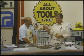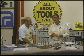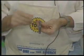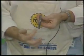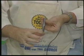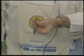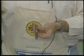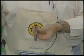One thing that I was really fascinated, and I was telling John this a little bit earlier, on a half-inch bit like this, and this applies more to the bearings, which we're going to talk about shortly, but on a bit like this outer portion of the bit might spin at about 34 miles an hour when you are running at about 21,000 RPM.